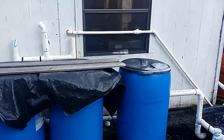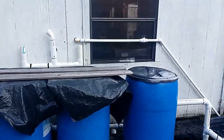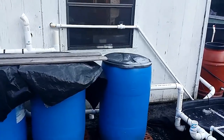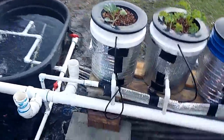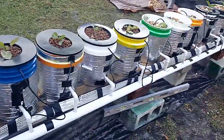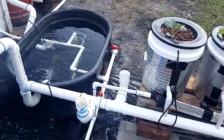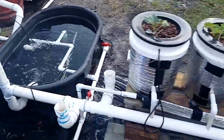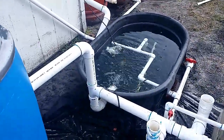Here are the barrels - I'd be much happier if I could get those black bags off, but I can't until I get a better cover. If anybody has suggestions for a cover, I don't want to use wood because it'll rot - and with pressure treated wood, you know the issues with that. I try to keep the system as toxic-free as possible. Everything is food-grade except for the PVC. I'm going to wrap this PVC because even without holes, light gets into the pipe and algae will just grow inside. Wrapping it will help insulate it and keep sunlight off it.